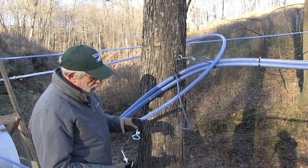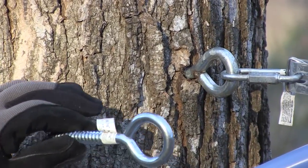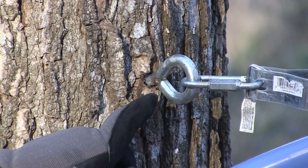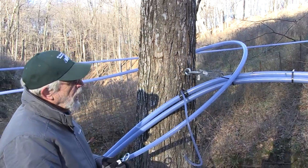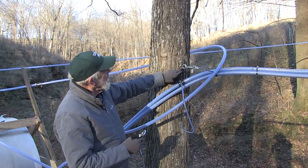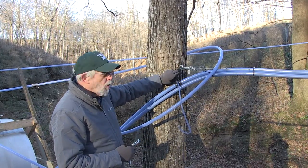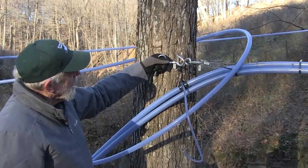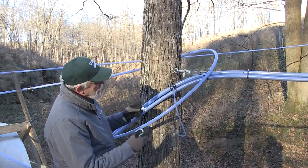This producer has learned early on that the eye bolt introduced into the tree — it's smart while it's still in the shop to weld the bend shut, as they've done in this case. Simply the pressure of the high tensile 12.5 gauge wire with several hundreds of pounds of pressure is enough to open up this eye bolt. Even though these are 7/16 inch bolts, they will open over time. So a word to the wise: do not use a J bolt or a hook — drill a pilot hole into the tree and turn this in.